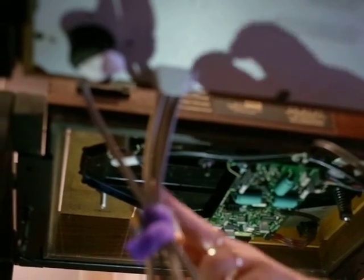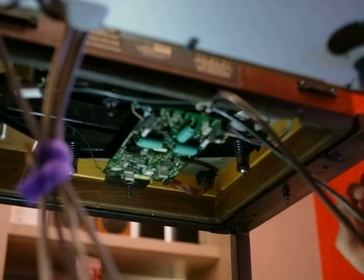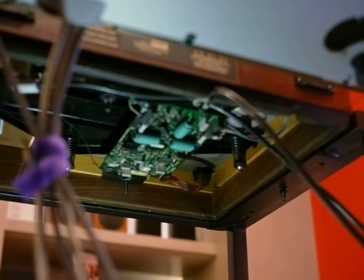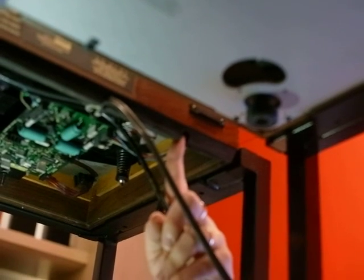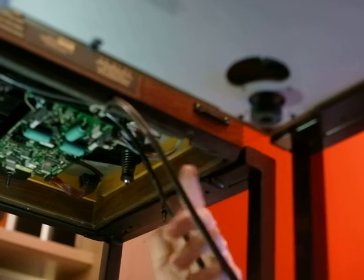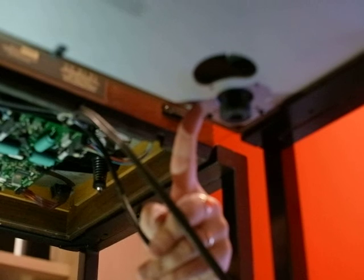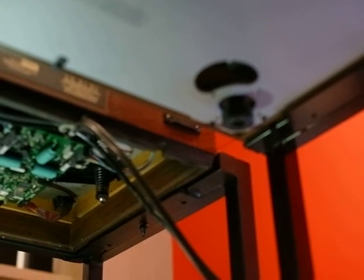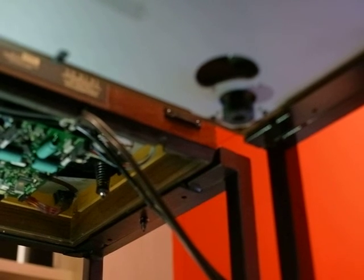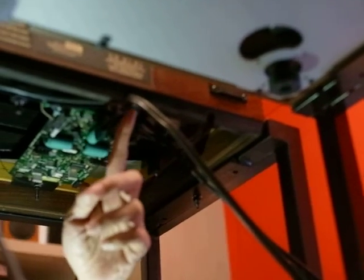Pretty close, pretty close. The one I'm aware of moving is the power line. I know the power line has moved very slightly over the years, and I know that because the new baseboards have the screw in each corner, and sometimes that screw is right by the mains cable. You cannot put the screw in, otherwise you hit the mains cable. The simplest thing to do is just drill a new hole and put the screw a centimetre further over. It's rare. I have done it, but it's not that common.